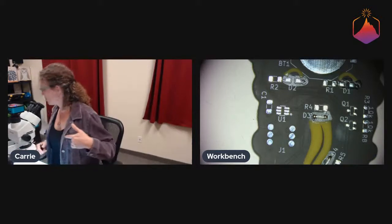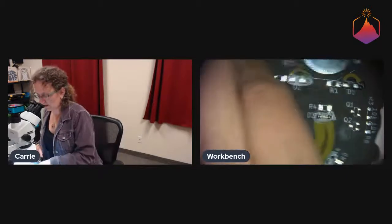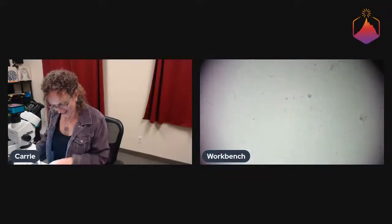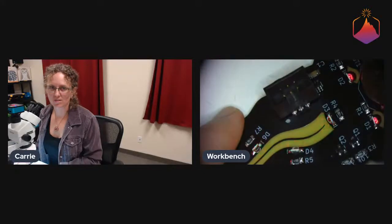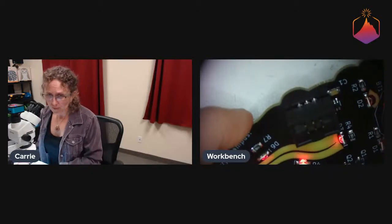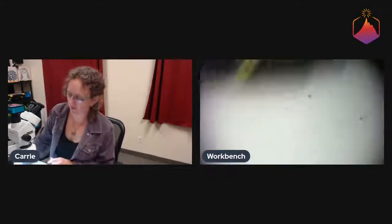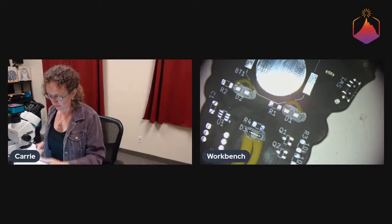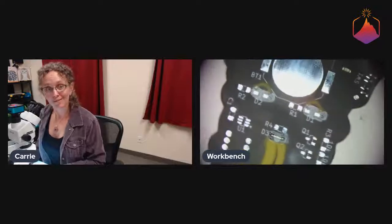I can actually show you what I'm talking about, because for our dev board, we did kludge in an actual connector, because when you're reprogramming stuff a lot in development, it's nice to not have to deal with pogos. So as you can see, that's the surface mount version that we've just soldered on top of those pads. This is just for us for development. So anyway, you get the board, you get a bunch of parts, you get the programmer, you get the pogo kit, and you get to do whatever you want with it.